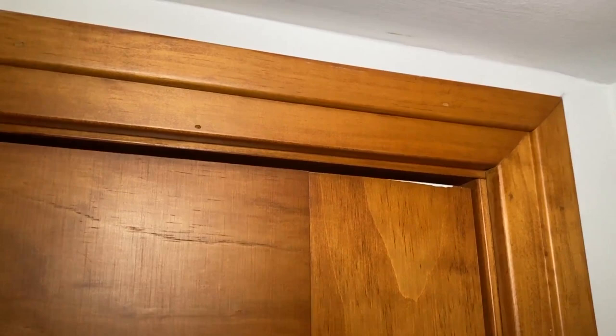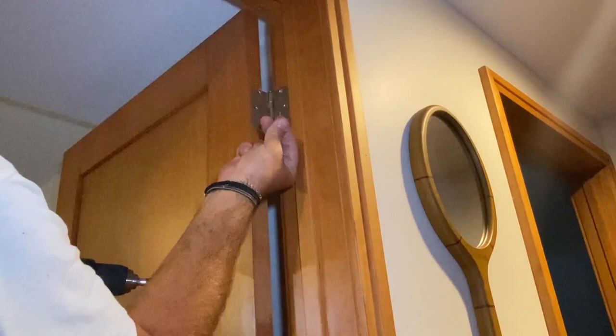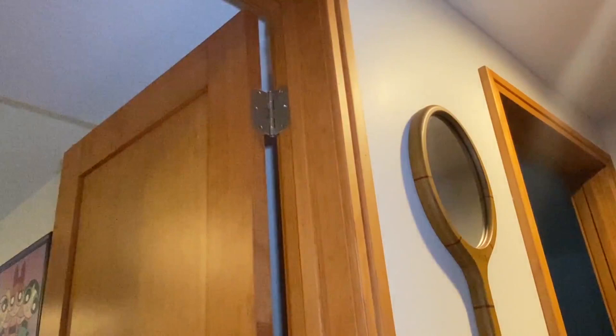Go on the inside — this is the top portion. You see how the gap gets bigger toward the side at the top, and if you follow it over by the hinge it's more narrow. There are a couple of fixes you can try. One: open up the door, take one of the screws out — it's going to be a short little screw. Get a longer screw, like 2½ inches, and with a screw gun drive that screw in through the frame into the framing underneath there, and it'll pull the door up so that the door closes.